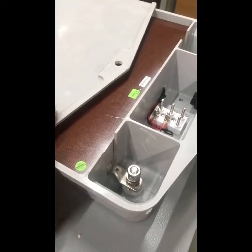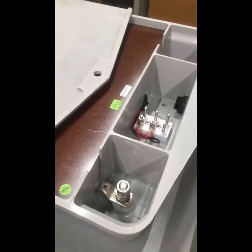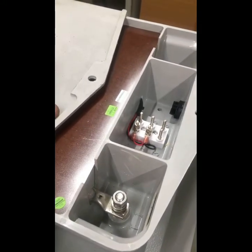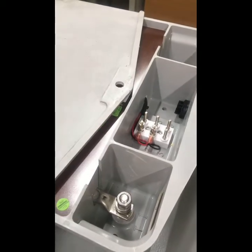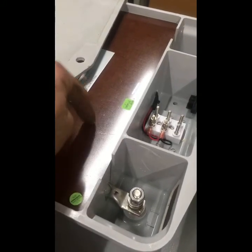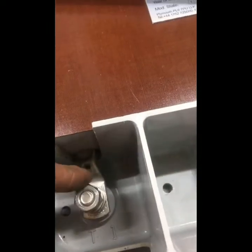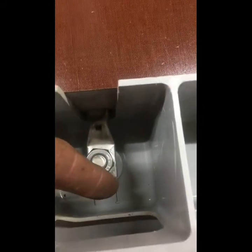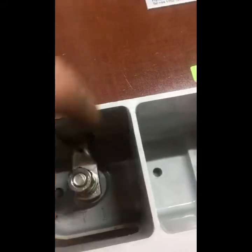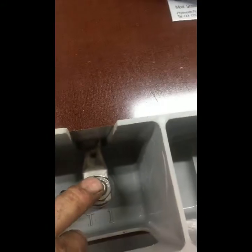Now this is one of our tuning units, our ETUs, or end termination units, and you can also get air core transformers, because you can have centre fed tracks as well. And these are moulded plastic bodies. The inside of this is foam inserted around the transformer coil that's inside there. And these giant lugs here with the locking nuts are going onto the actual rails, so you have your termination cables coming through the holes in the bottom of this onto the rails that way, and then this way they go onto the nuts, and then you have extra locking nuts on top. And these are torque set, so they don't come loose.